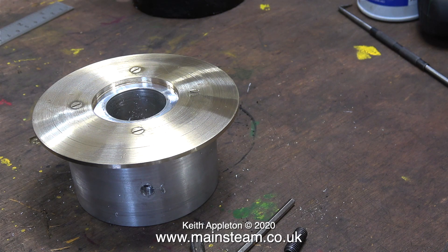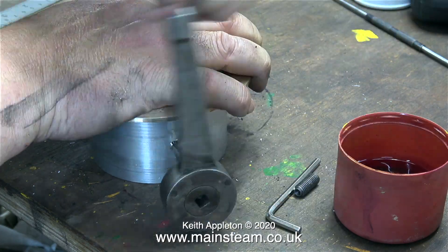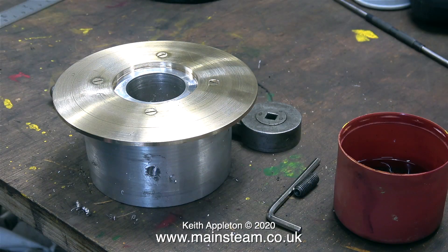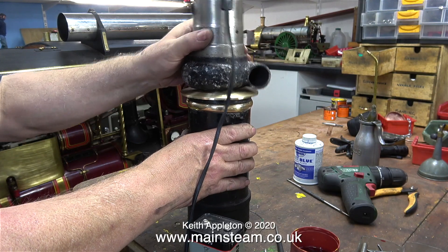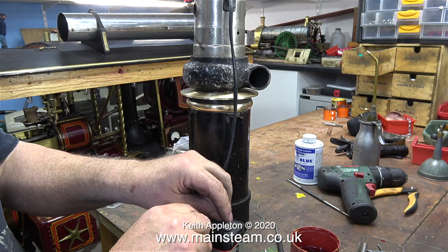To finish off the job, I drilled a hole all the way through the side of the piece of aluminium. Whilst it was in the drilling machine, I left the tap in place and started to thread it, then I finished the job off on the bench using this very useful ratchet tool. I'm going to fit a metric grub screw — an M8 grub screw — which is perfect for just clamping the blower in position.